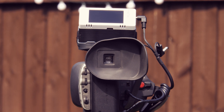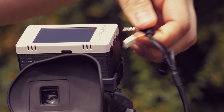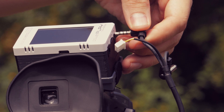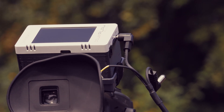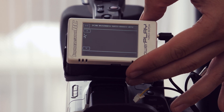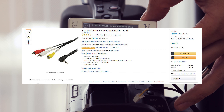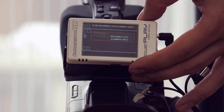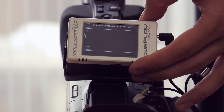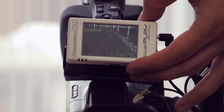Connecting the PowerPlay to your camera is a breeze. For my GL2 the supplied cables work a treat — they've got some extra bits for powering the goggles which I might chop off at some point, but the fact that it comes with a short coiled cable and a much longer one gives you loads of options when it comes to mounting the DVR. If you've got a VX1000 you'll just need to pick up a 3.5mm to RCA cable, the same as what we used in part one. I don't know if it's just my particular unit but I found that I only get a video signal when the 3.5mm jack is not pushed all the way in — it doesn't really cause any issues but it's just something to watch out for.